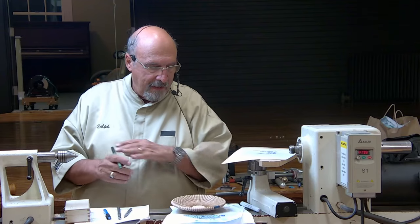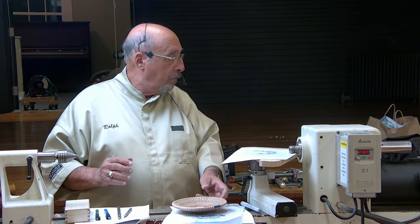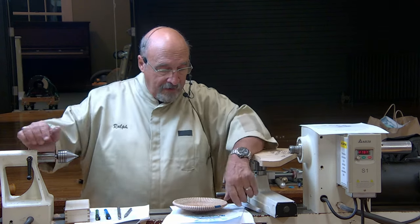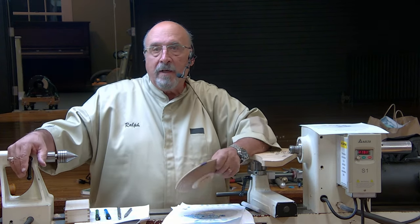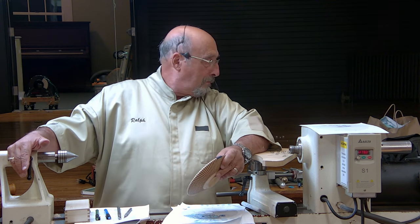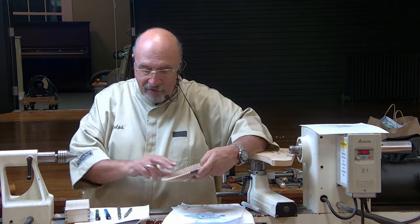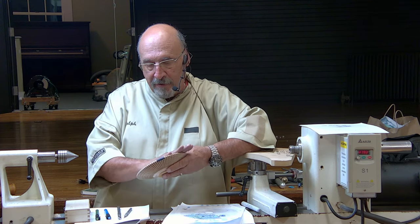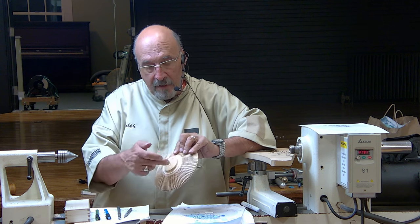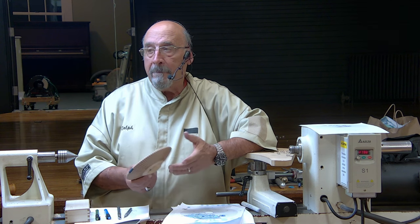It's not for everybody — I don't do a lot of these because it's very labor intensive. I'll do it when I know I'm going to have a period where I can't turn or do anything else. I'm having knee surgery next month and I've got three of these things ready to go. Then I put a coat of poly all over this to get into the grooves, then I turn off the tenon, and then you spray lacquer. And that's it.